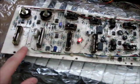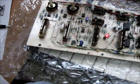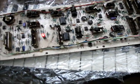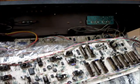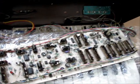Now all I've got to do is wait on one slider to come in, which is for modulation on the filter — because as you remember, you were missing that slider. And I'm going to calibrate this thing up for you and get everything mounted back, and hopefully you'll have a very nice playing little MG-1 for a long time to come.